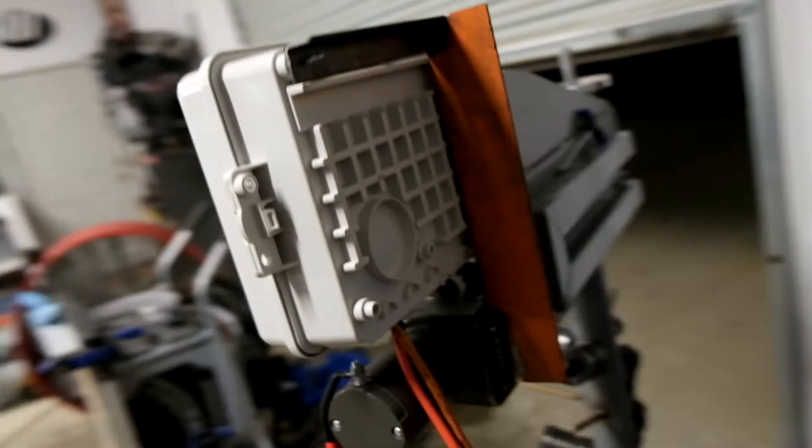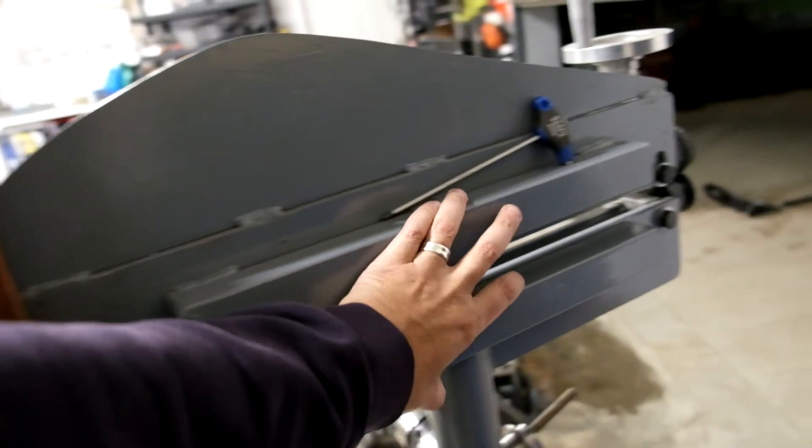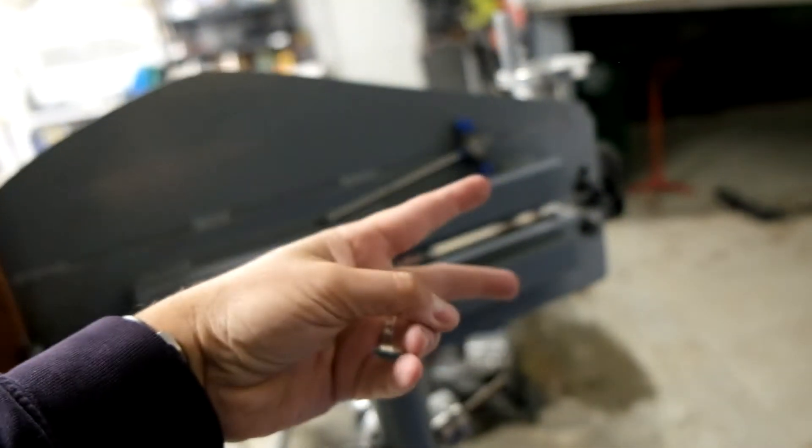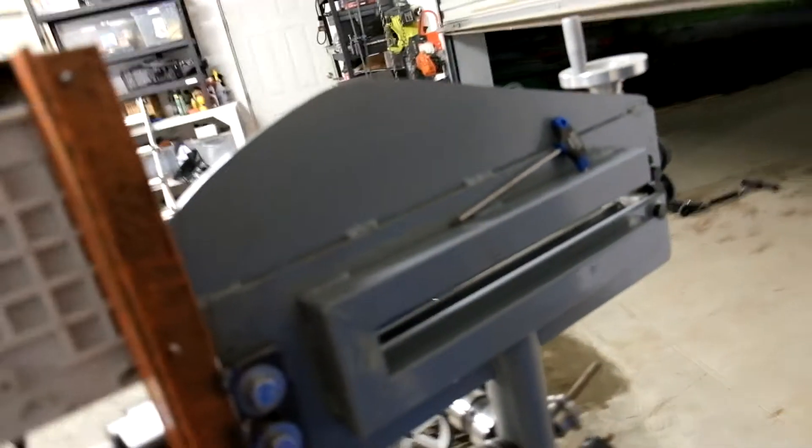So here's what we're working with. This is just some angle iron — I welded it to my motor adapter plate. Another thing I've done since the last video is I stiffened the backup. This thing does not flex now. Before, the top and bottom plate would walk away from each other — it doesn't do that anymore at all. So I get a really well-defined bead out of it.